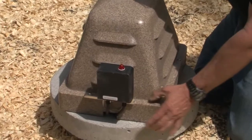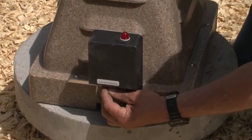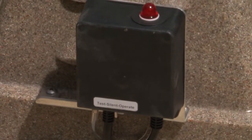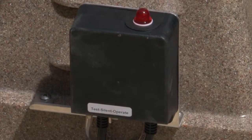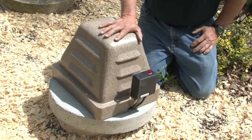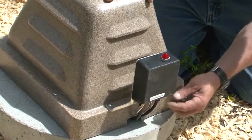We have the power back on and it's running. You can hear how quiet it is and it doesn't consume a lot of energy. This is a low pressure alarm. What it does is let you know that over time the diaphragms will weaken in the pump. You can get replacements and replace them. It lets you know they're not putting out as much air as before, so it's time to rebuild them. If this alarm goes off, it's not a dire emergency — it's not backing up into your house. You can silence the alarm, get the parts in, and fix it.